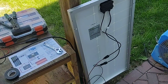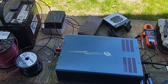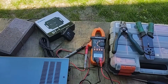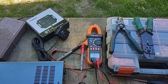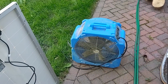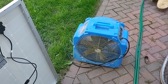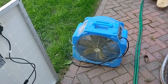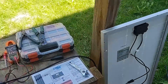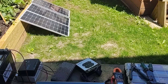Now I'm just going to toss this in the sun and test out the voltages of what it's producing with my multimeter. I also have a test load just to see how much the voltage drops when this is being run. This is about three amps, so about 350 watts. So if everything is working correctly, the four panels should be able to power it pretty easily.